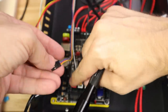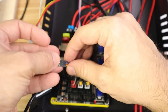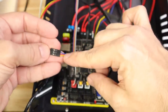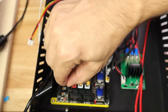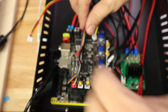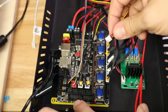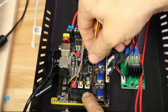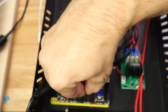Let's double check our servo pins for the other BL Touch plug. According to the pinout, it's going to be ground, power, and pin 2.0 as the signal. So this is the correct orientation — ground, power, and signal pin. We're going to plug this into the servo pin right here and push it all the way down. Next up we have our filament runout detection. Filament runout detection for E0 is going to be 5V, ground, and signal — it should work without any additional modification.